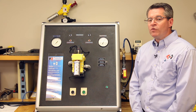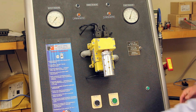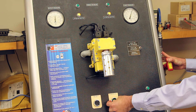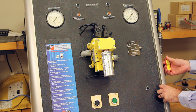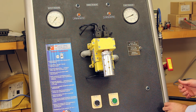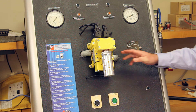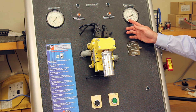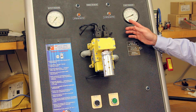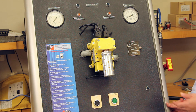Another common fault is the removal of the supply pressure while the valve is energized. When I resupply pressure, we're going to be in a faulted condition. What has happened is that we've faulted both sides of the valve, and now we have an increased pressure drop within the valve, so our supply pressure is much lower than it was. That causes the valve not to reset because of that pressure drop.